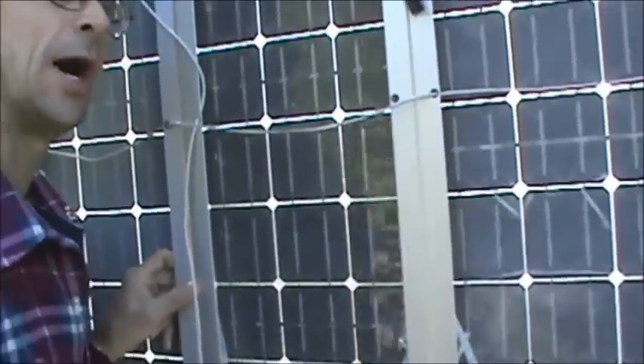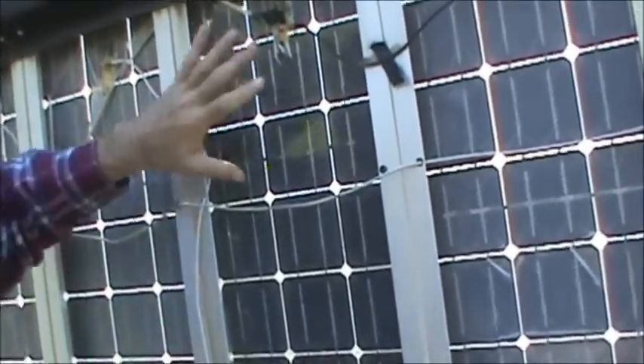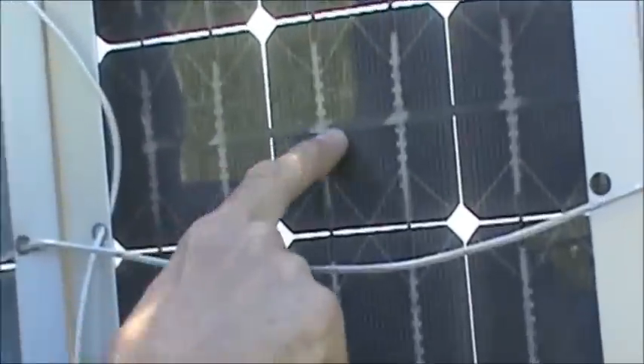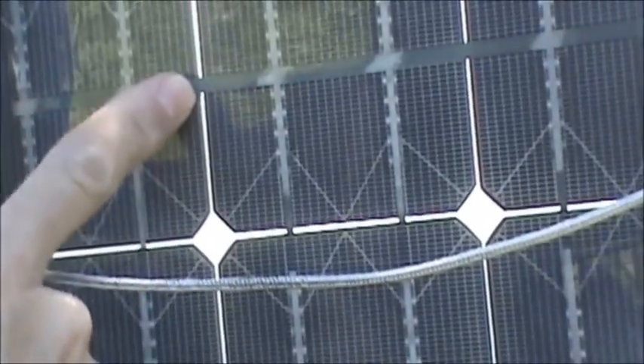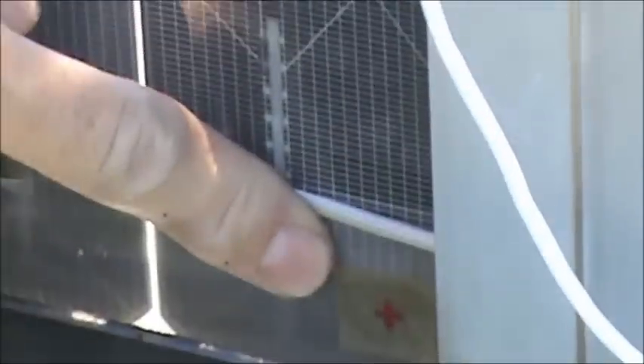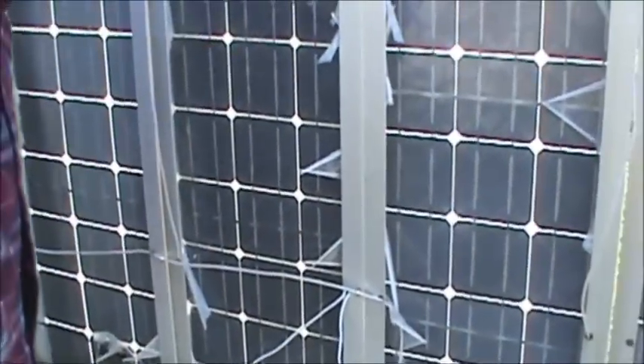Let's go nine times twenty-six — they're at least thirty-six years old, these panels. You can turn this four volt panel into a 12 volt panel just by using a Dremel. You see between the cells this copper strip that conducts the electricity? If I were to cut it right there with a Dremel, this strip would be separated right up to the next one, and there's one down at the bottom. See where it says positive? This would have been the positive end of the panel. What you do to turn it to 12 volt is take a wire from this positive to this negative, and the power would flow all the way through — then this positive to this negative — and that's how you get it into 12 volt.